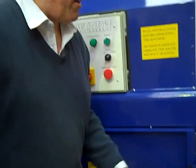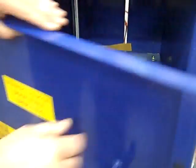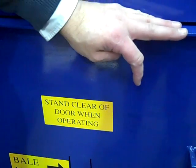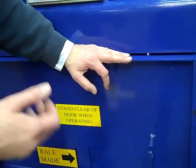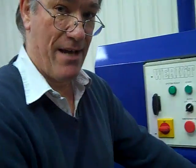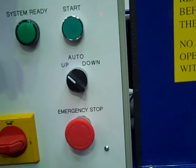When it stops, I'm going to open the door and you can see it hasn't gone all the way down — it's going down so far. Can you see this black and yellow line here? That black and yellow line would actually line up somewhere on this door in a little while — just there, you can just about see it through the window. So when the plate is coming down and the black and yellow line stops somewhere in there when it's going down on auto, then you'll think it's full or nearly full. Actually you can't overfill this machine — it's just that you have to bear in mind pulling the bale out at the end. It's got what we call an intelligent relay inside here, and it actually counts the plate down and it counts up. Now it's down, so according to the machine it won't work on down — it'll only work on up. So we put it on up to make it come back up and let it run the cycle until it's back up again.